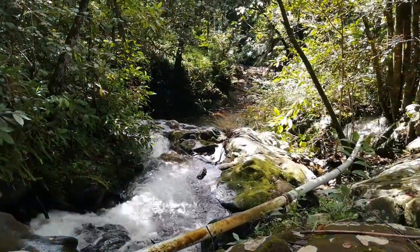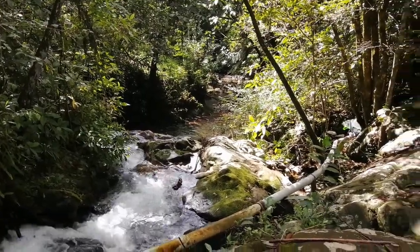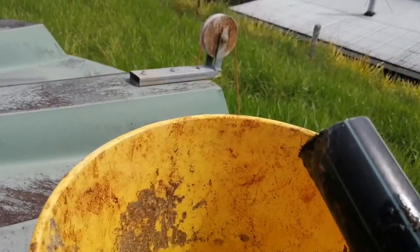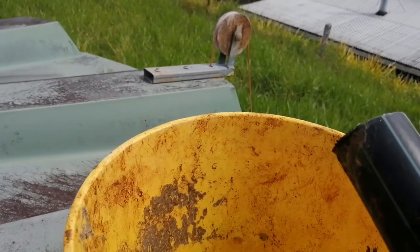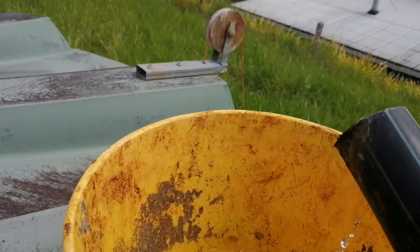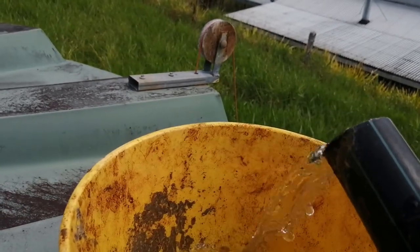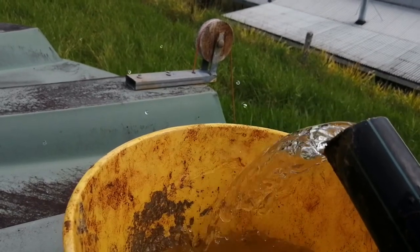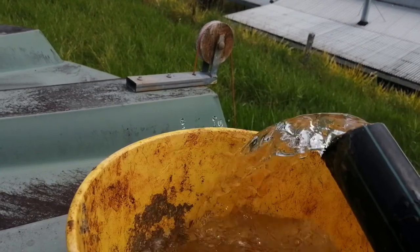There's a nice 10m waterfall below this. The output of that Bunya PA-13 pump, working off that 1.8m fall, is putting out about 12 litres a minute. We can go faster than that because we've got the valve restricted — we've got the full flow available. They don't need that much water and the tank's full.